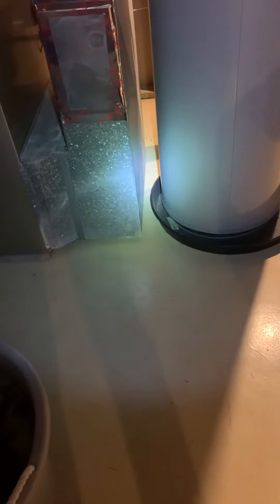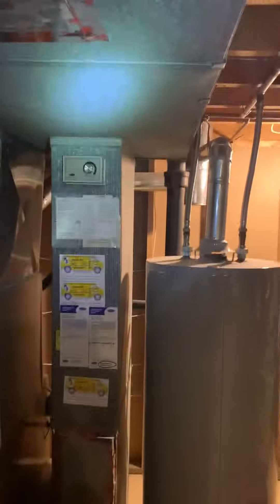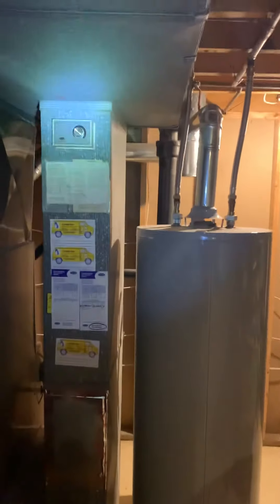There's an old humidistat, but the humidifier is gone — there's no humidifier in the system. So we can start fresh with the new return air drop, get better airflow. Actually, looking at the bottom of this, we can probably only go 10, but if we can go 10x26 rather than 9x22, that'll help things out quite a bit.